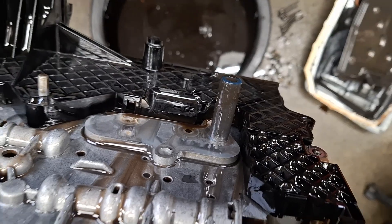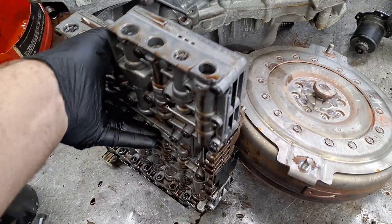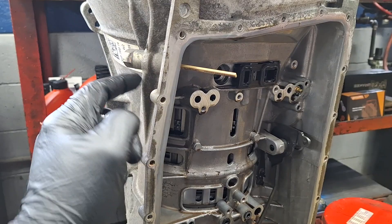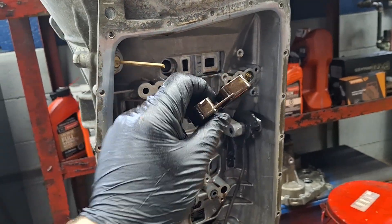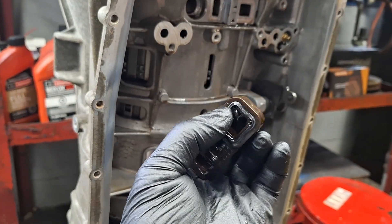That feed tube seal came out on it — that's normal. You just need to pull it off and put it back in the hole. Here beside the valve body is the torque converter area. 19 millimeter. You can pop your dipstick out if you want, but here's your 7F401 seal — replace it. It's made of plastic. That is a pump seal.